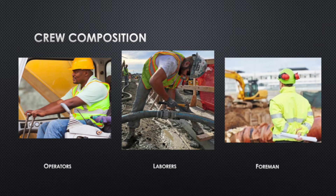The second would be laborers. Laborers are the guys in the trenches — usually about 50% of your underground crew is composed of laborers. These are the guys installing valves, checking grade, gluing sticks of pipe together, pouring concrete, setting concrete — all of the above. They are the guys getting it done.